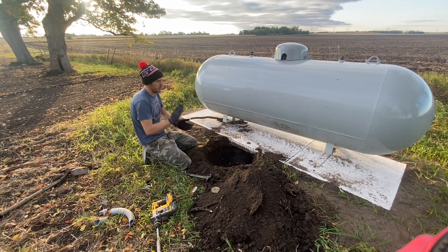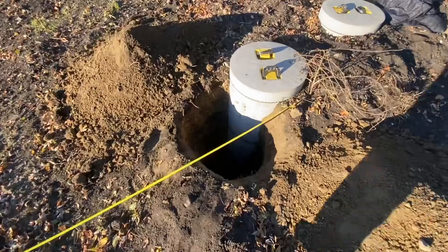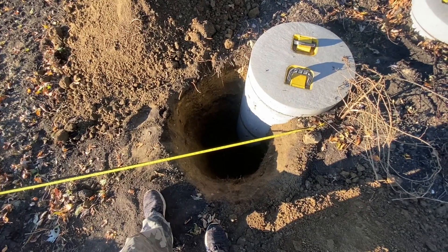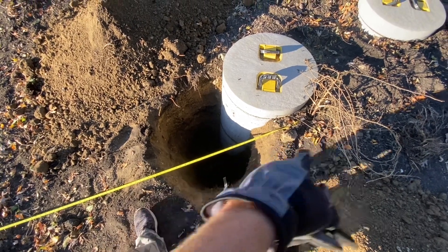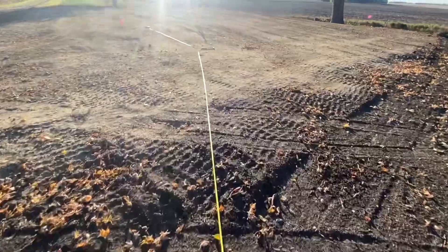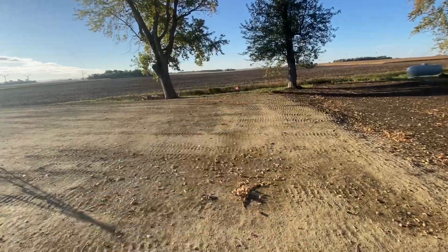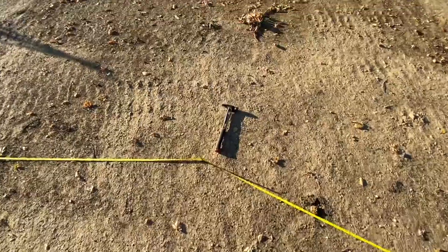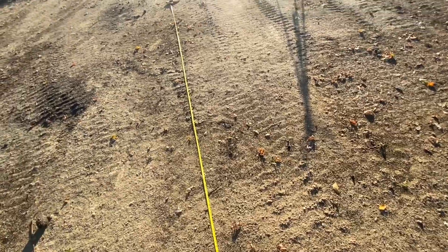Building a lot of character today with all these holes we're digging. I'm running out the numbers we'll need for our four-inch septic hookup. The drop into the septic tank is right here, so I gave myself a little bit and ran the straightest line over to the side of the barn. These pink flags — this one and that one down there — are going to be the edge of the lean-to, so I came in about four feet. Inside the barn we're going to have a four-foot stairwell, and then there's a 12-foot lean-to before the building even starts, so we're at 47 feet.